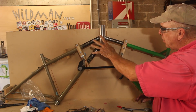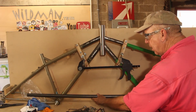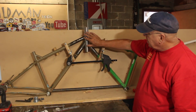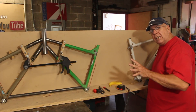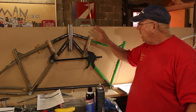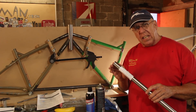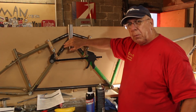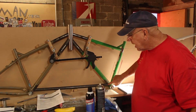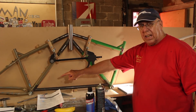Here's what I have for my common head tube with the two frames tied together. Now I need to triangulate that by using a tube down here to join them at the bottom. I have the connection between the back two frames all worked out — the triangulating tube and the central head tube tying it all together. Now we need to tie the two front frames together, which means disassembling this to get the fitting done. All the tubes we've worked with, except for this head tube, are what they call double butted — meaning the tube is thicker at the ends than in the middle. These frames used double-butted tubes and I know I'm close enough to the end that I'm in the area of the double butting, which I'm confident of.